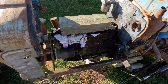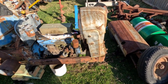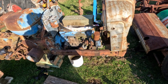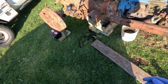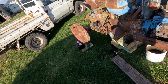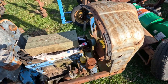I just realised the engine crane's going to have to go there to get that out. Might not be too bad — I only need to come forward that much just to get the flywheel clutch clear, drop it on the ground. Yeah, might be able to come out on the ground, crane round the other way, pick it up. The crane's not going to roll on this very well — I've played that game before. You pick it up, use the Land Cruiser, and drag the crane. It sounds dodgy but it actually works — those wheels will just drag on the frame but it'll move.